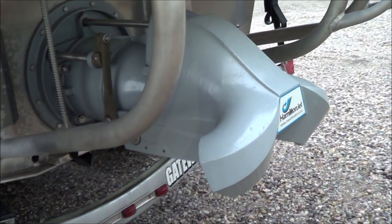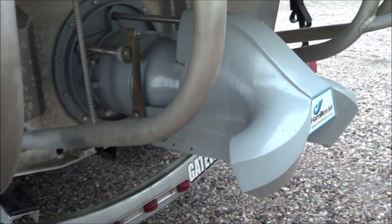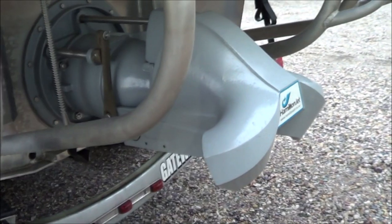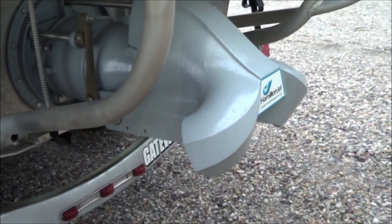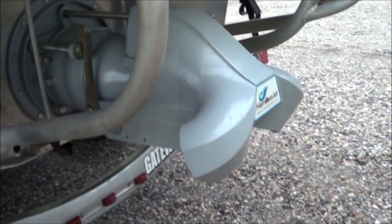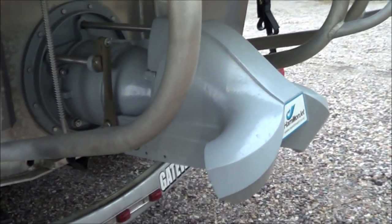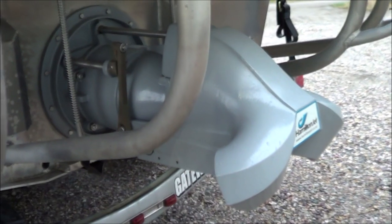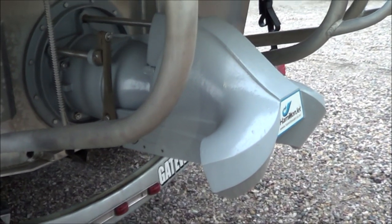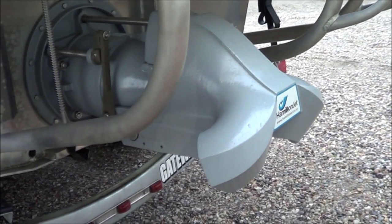I think that's still kind of overstated. Possibly the cable could be improved in some way, either the routing or the quality of the cable itself. I looked online and found that a typical multiplier for input force versus output force is about a factor of 2 for a 360 degree bend. So the fact that I can dangle 5 pounds of chain off the back of the bucket and have it be almost impossible to move the throttle at the helm implies that there's something else going on. So although it's a lot better now, there's still room for improvement.